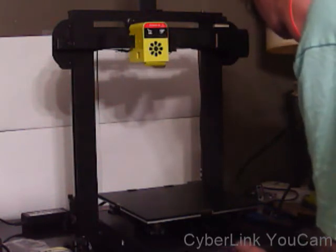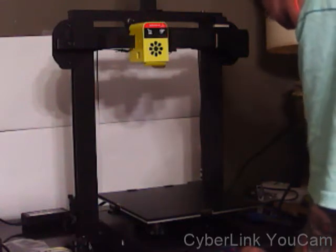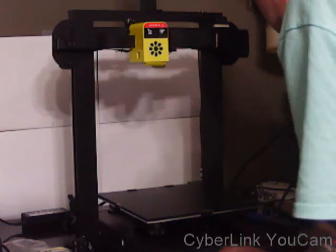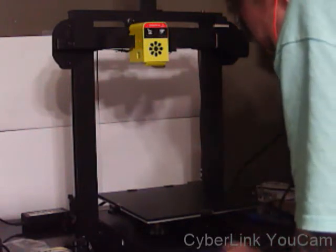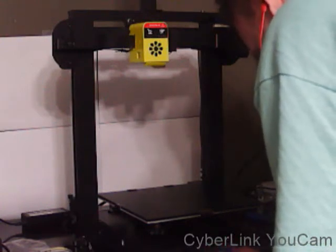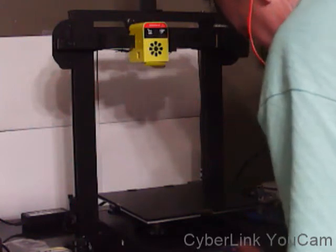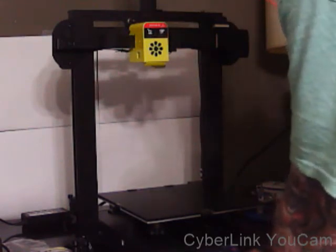So we're going to go hotbed, extrusion. It doesn't give me the option to do both. Let's see, preheat. Now let's go back, tools, preheat. Oh, this takes you down negative. Okay, let's see what this does. That goes 1, 5, and 10 degrees Celsius. So with your hotbed, basically this is a preheat. There's nothing set in here to automatically preheat for PLA or PETG or TPU. You have to do it all manually.